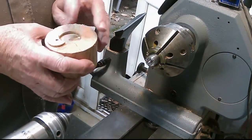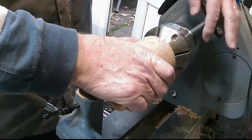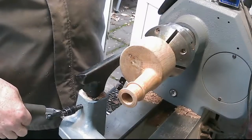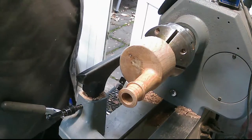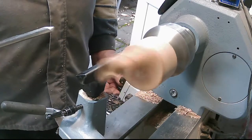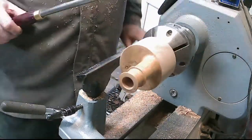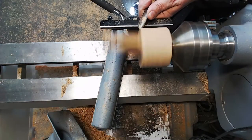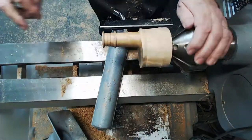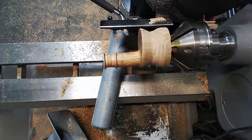I'm sure there's a better way of doing this that I'll have to think through separately. I've now got a wobbly bit left on the bottom where the mortise has cut through the original tenon, so I need to pop that on the belt sander otherwise it won't sit neatly on the O'Donnell jaws. That's been well tightened up and centered so it feels safely on the jaws. Now it's time to re-profile the bottom part - watch your fingers again - and try to make the base look a little more interesting. I grabbed a half-inch spindle gouge and thought a bit of an undercut would work, giving it a shape making it look like it's on a cliff edge. As I was doing this I thought I could probably get a captive ring on the bottom.